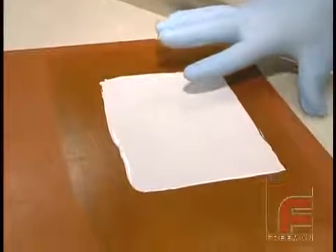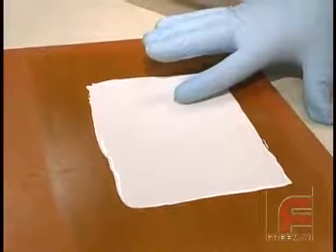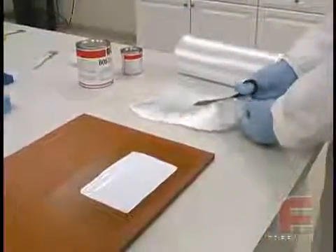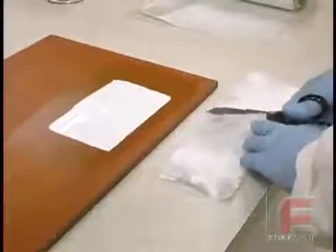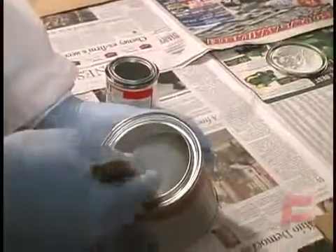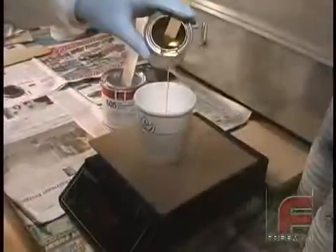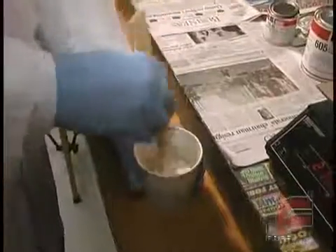Earlier, we had tested the material and found the epoxy to still be too tacky. Notice the material coming off the part and onto the glove. Before applying the laminating resin, we cut our fiberglass cloth to the correct width and length using standard scissors. Since this is an uneven ratio material, we followed that procedure. For more information, please refer to our other videos on weighing and mixing materials.